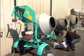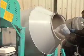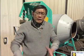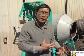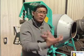Whenever you're starting out, you want to put your mix in the mixer first, and then slowly add water. To use the mixer effectively, take your admixture and your Sacrete and put them in before you add the water. You want to make sure that the fibers, the color, and all the components within the admixture mix thoroughly with your Sacrete. I always like to say that good design is the most important tool to execute a great countertop, but to execute that countertop, you need to know what tools you'll need and how to use them. This is Futong Cheng.